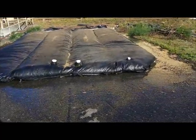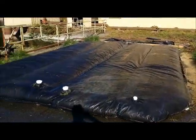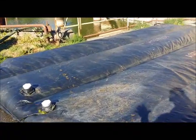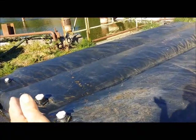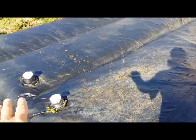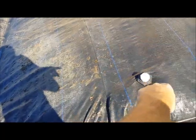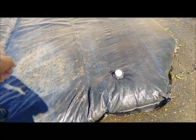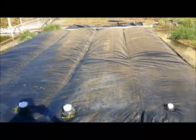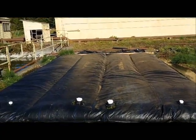We're done with the installation. Now, if we were going to put slurry in this, once it's full of water, the slurry could go in at either end. If you put water slurry in this side, that'll force all the water out the other side until the slurry gets around. We'd have to do it once or twice to see how that works, but certainly putting water in first, everything equalizes.